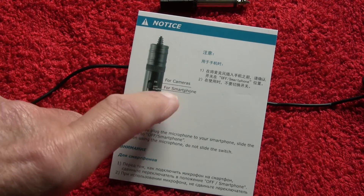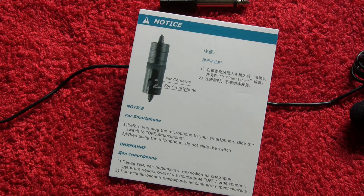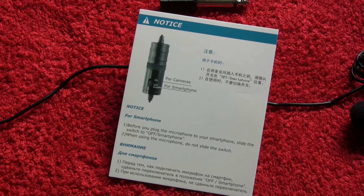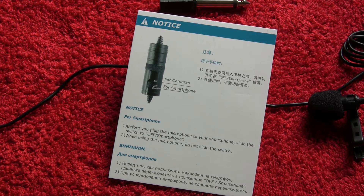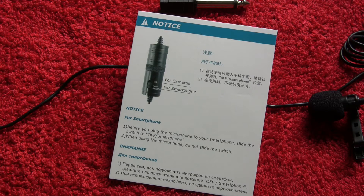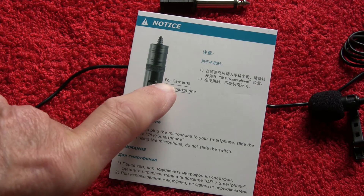This is what is known as a condenser microphone, which means it needs a polarizing voltage to work, and that's what the 1.5V battery provides. It will also probably have a FET preamp inside because the condenser mic inherently has a very high impedance, and the output required for most appliances would be low impedance — so that's basically what the FET will do, plus give you a degree of gain, as the output from a condenser microphone is very low. We could call it a capacitance microphone really.